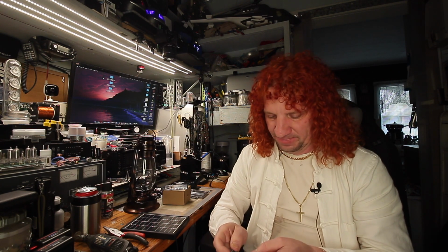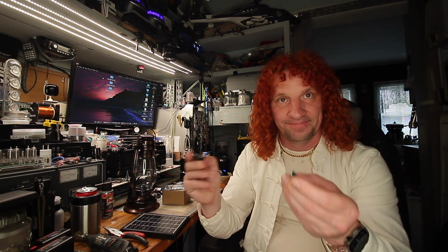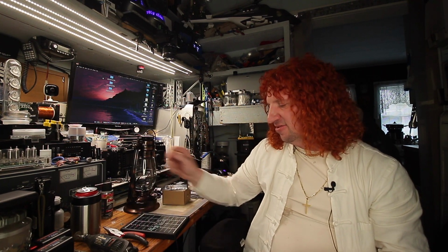So that's how I wired it in my flagpole. It works good. Not a problem. So, like I said, the battery will be connected here. The solar will be connected here, parallel lines to the solar input on this. And then the load of this, because what's a good thing about this is that this also has a live output. So anytime there's power going in from the solar panel, it's trying to power whatever it's connected to. So that's good. So that's the circuitry of this little guy.